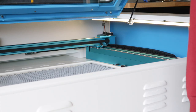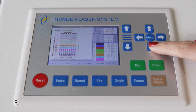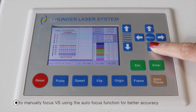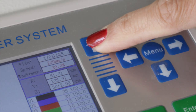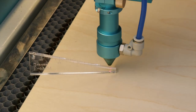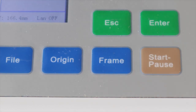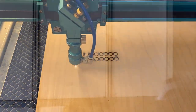Get your wood or material into the laser and make sure it's as flat as possible — use magnets or clamps if needed. Once you have the file on the laser, move the laser head using the arrows on the right side of the panel to where you want the project to start. Move the bed up or down to get it fairly close to your material, then use your focus tool to get as close to six millimeters as you can — that's our most accurate focal length. Hit Origin and then Frame, which lets you see exactly where the project will be cut. Close the laser, hit Start, and let the machine do its thing.